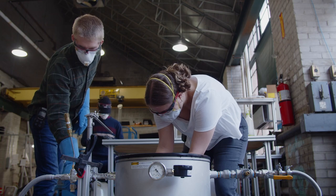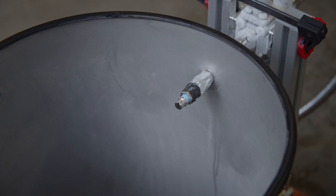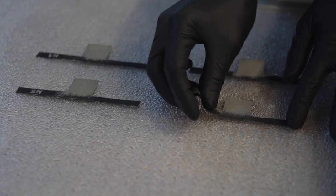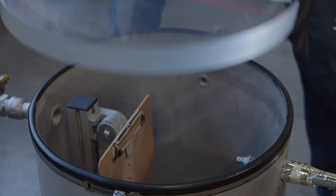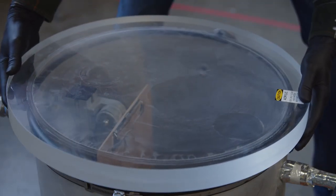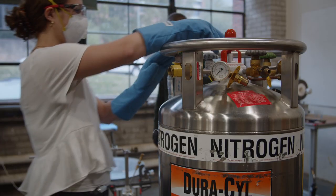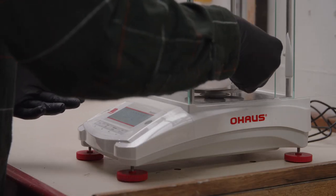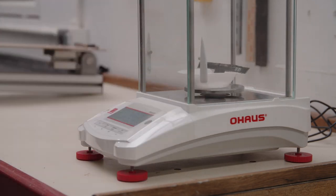For the first vacuum test, the liquid nitrogen application method was a single spray nozzle on the inside of the vacuum chamber. For our sample, we used another small portion of dust-treated Kevlar Nomex weave. This vacuum test showed similar dust removal to our localized test, with over 98 percent of the dust mass being removed. These results bring our technology readiness level from three to four.